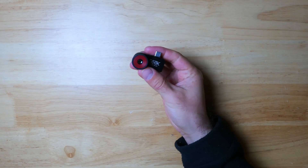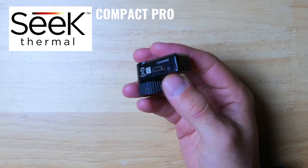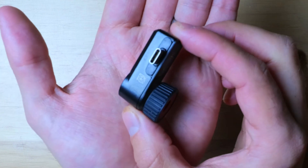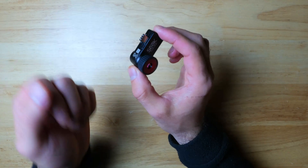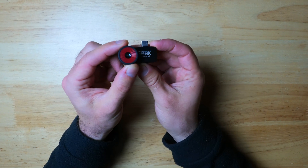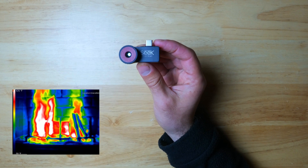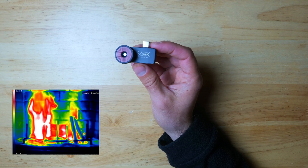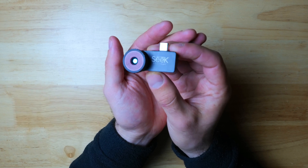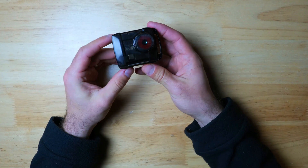Let's dive in and take a look at the camera. As you can see, it's incredibly small — a lot smaller than I was expecting — but that's good because it makes it very convenient to always keep with you. This version has a USB-C port and should be compatible with most smartphones and tablets with that type of port, but they also make a lightning adapter for iOS and another with a micro USB port. You can also adjust the focus of the lens by rotating this ring. Inside, we've got a 320 by 240 thermal sensor that can detect temperatures down to negative 40 degrees and up to 626 degrees Fahrenheit. The camera has a 32-degree field of view, and it also comes with a nice little waterproof case, which is a great way to protect it and keep from losing it.